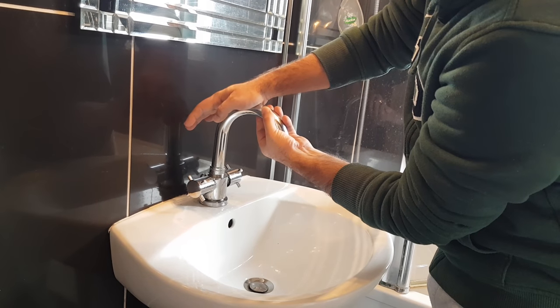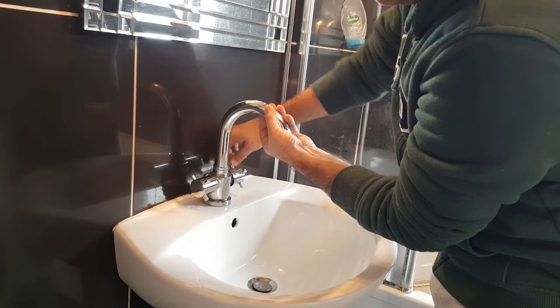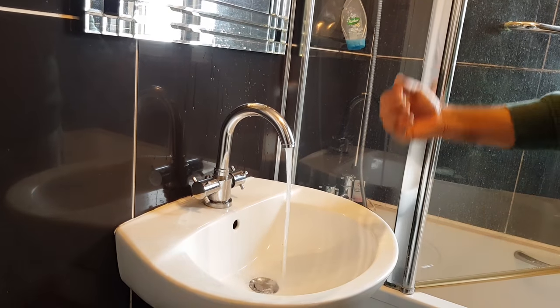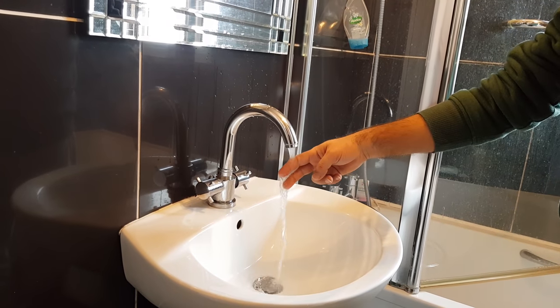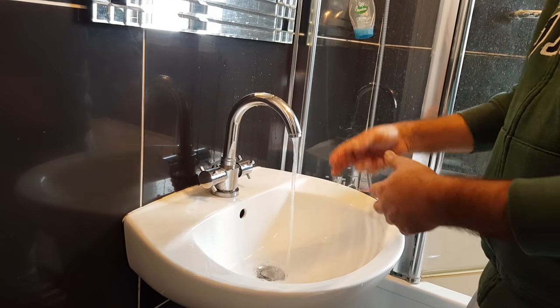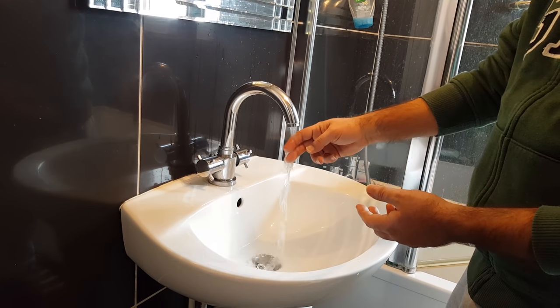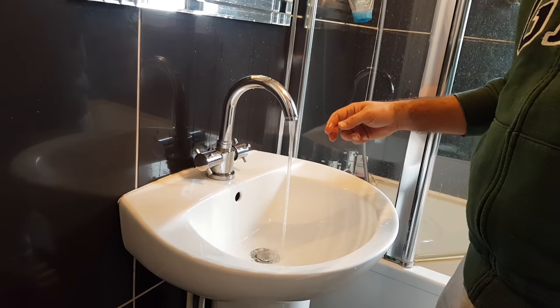Leave it open for about 10 to 15 seconds. Once you're happy with that pause, just switch off your cold water and let the water run — that's your hot water. Your system is now unlocked. You will see a reduced quantity of water for the first minute or two, but eventually it's hot water. I can't even touch it. Thank you for watching.